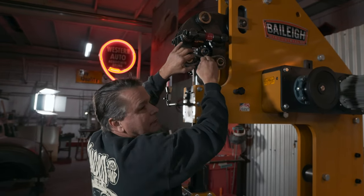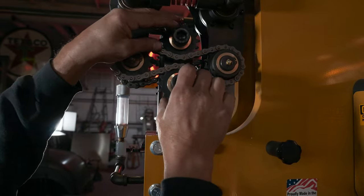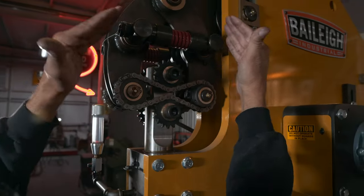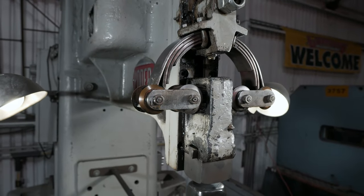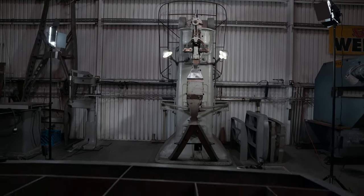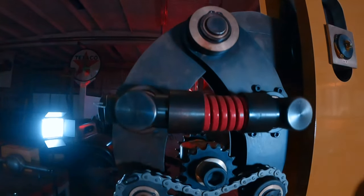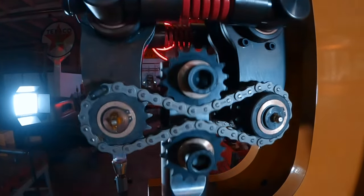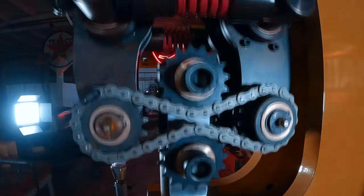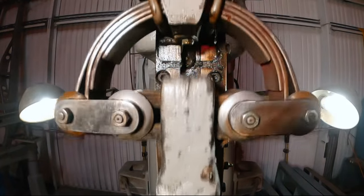This chain is the belting that's found in the Yoder. On the Yoder ram, the hole that the belting goes through is this upper and lower sprocket — this is where the belting is going through. Then the arms come around with the spring. So instead of having a bow spring, this entire mechanism that pivots up here with the spring in the middle is the entire spring. It's going to give us the same action as the bow spring. We have that sine wave — it lets it come up and come down. As it moves, this moves through the spring. The spring stores energy; it has energy on the stroke down and stroke up. So you have this constant spring energy, just like on the Yoder. It's just more mechanical.